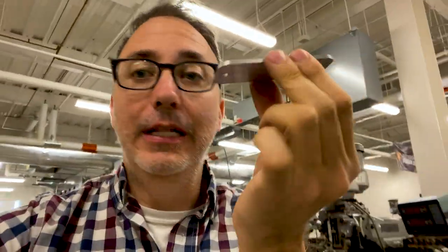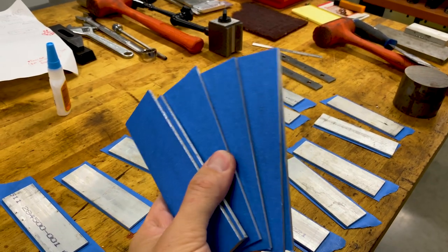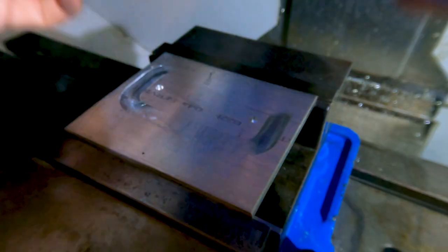The challenge on these guys is that it's a thin material and I wanted to put a radius all the way around, but there was just no way of actually clamping onto this in a vise. So I figured out super glue and painters tape — it actually works. I learned this trick from watching a great video by John Saunders at NYC CNC. I'll put a link in the description of this video.